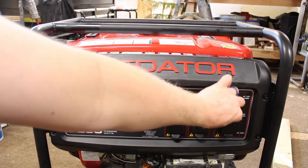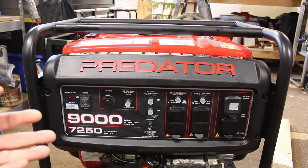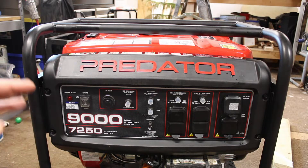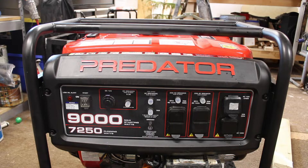This is the outlet I will use if I have to run our house. I did run this generator on the house. I was able to get the HVAC running, but it was really pushing it, and we only have, I think, a three-ton unit — you probably wouldn't want to push it too far. Our whole house without the HVAC, I think we drew 11 amps per leg, and this generator is more than enough to run what we have.